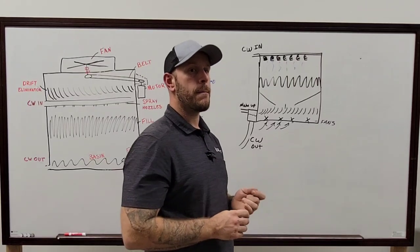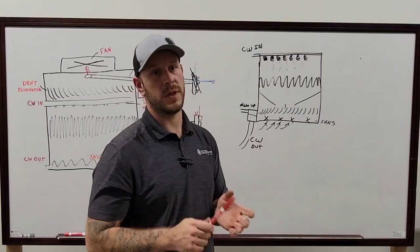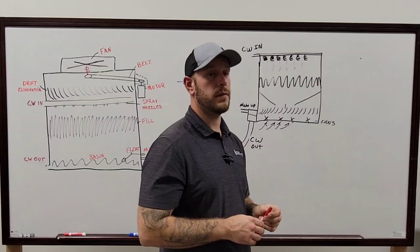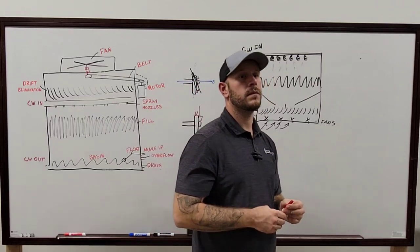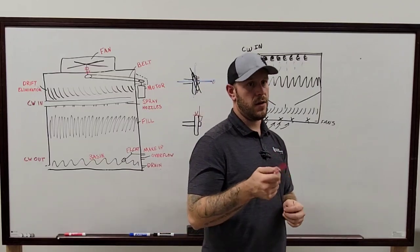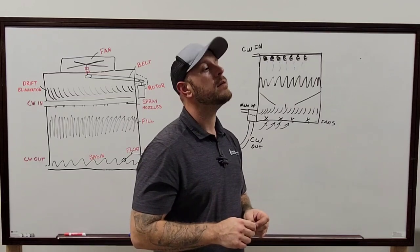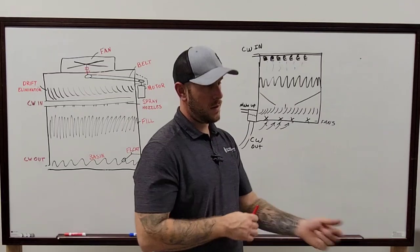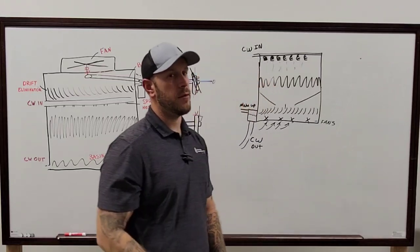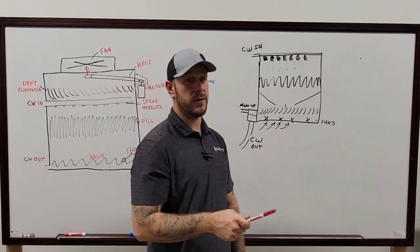And my understanding is on those little easy lasers, that red adjustment, that's the one we're talking about. It has a zero mark. Yes. So you don't have to align it. Those other tick marks are for if there is an offset. Exactly. It tells you how far off it is. Yeah. No, but you need to be careful too that the walls of each of those sheaves are also equal, especially with an adjustable pulley. You can really screw yourself up with that. Yes. I've seen a lot of people do it to where they don't want to use both the red tabs. Use both of them. Yes. If you have three of them, use three of them.